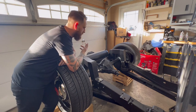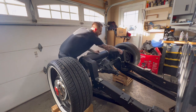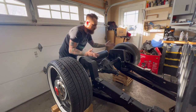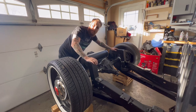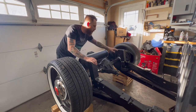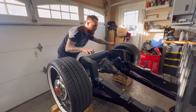When I talk about a bridge, all I mean is two bars that we're going to connect to this notch. That's going to stiffen everything here and give it some cross support to keep things from wobbling around or messing up. So it's a simple thing today but very crucial. What we're going to do is grind down the two spots where these bars will go, then tack those in, keep tacking, get a good weld, and grind it down to make it look really good.